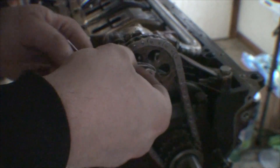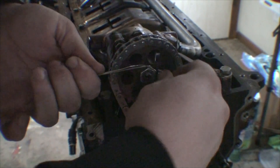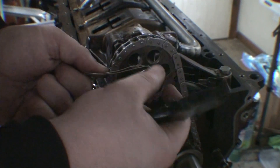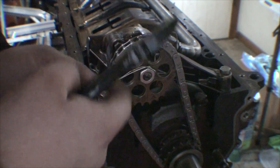The safety wire pliers I have will wind the safety wire clockwise. So I'm going to get a twist going down here just so that it's tight. The reason why we're twisting in this direction is the nut has a left-hand thread. So you want to put tension on the direction in which the fastener tightens. And right here is where I want the twist to end.